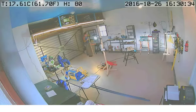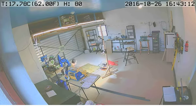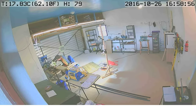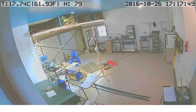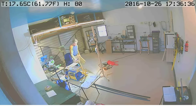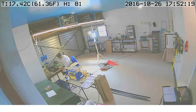I'm taking some notes there and measuring and finding out how long to make the legs, which I've laid out on the floor there. Testing out the new chop saw, the Evolution Fury 3 compound miter saw, and cutting the legs to the right length so the table will be at a height about as high as my elbow when I'm standing next to it, which happens to be about a meter off the ground.